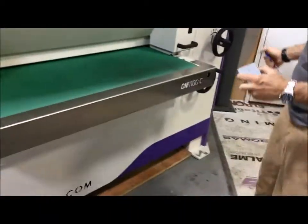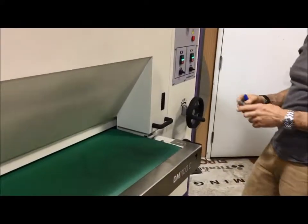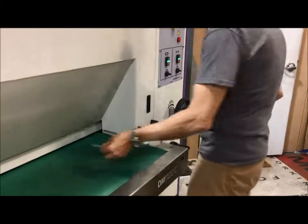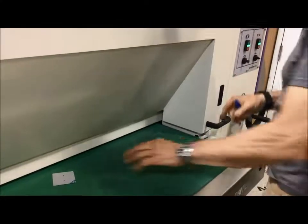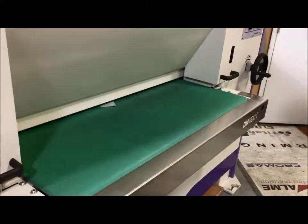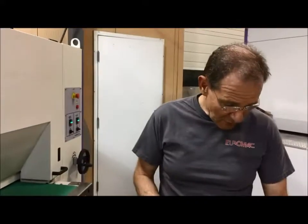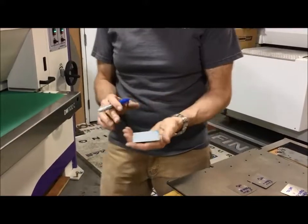If we go back to this now, we would reduce the pressure a little bit, right? We would still run at 3 feet a minute. No, sorry, we would run at 70% of course. So we would bring the belt speed down, and you can hear it by the sound that we have a lower cross belt speed here. And then we would run one part 5 feet per minute at 40% and very low pressure, and then you see again that the PVC would be fully intact.